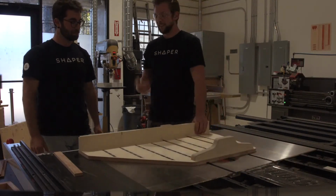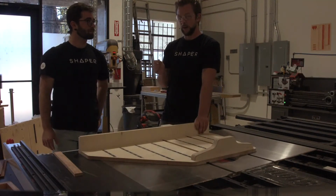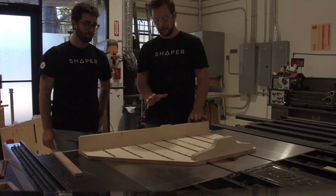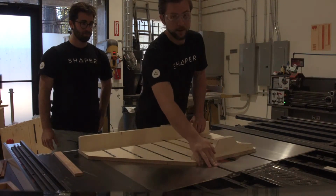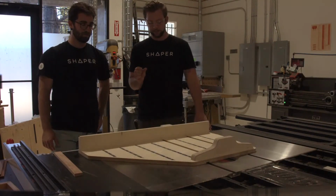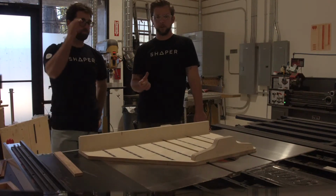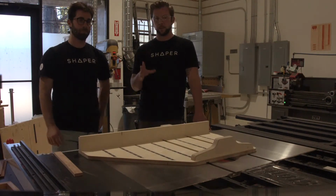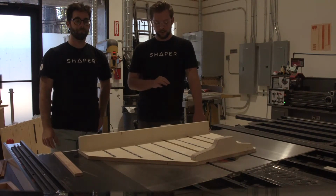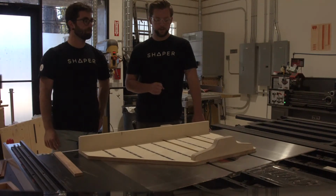So one thing that Russ went ahead and did, he made our rails before any of this started. He made those rails to fit exactly into these tracks on our table saw. So he got that dialed in. Used 1/2-inch ply. A lot of people use hardwood. We decided to use ply just because it was super dimensionally stable, and we weren't going to get any movement, and it seemed to be plenty hard enough. But I'm sure there's other opinions out there about that.